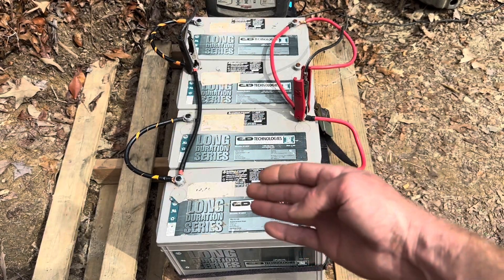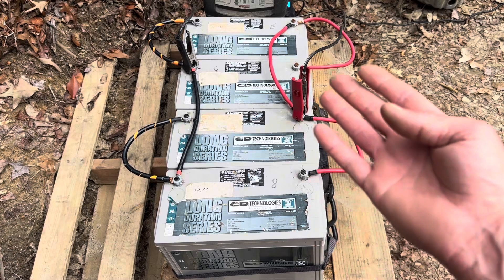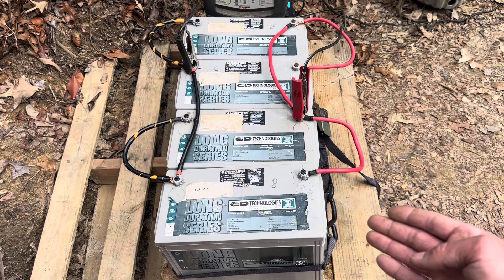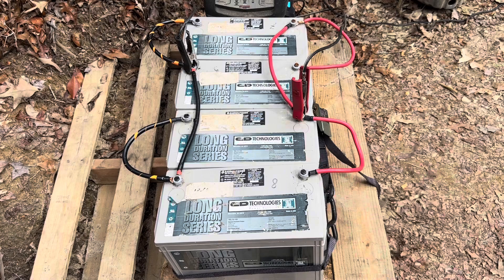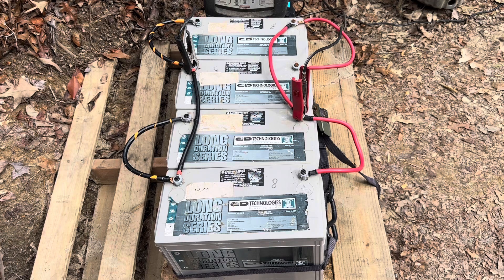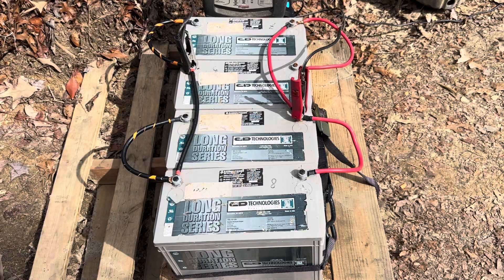This will work for any pack with an even number of batteries - six, eight, tens - it works the same. I hope this helps somebody with wiring their batteries in an equalized way. It's a straightforward method, no extra wire cost, and you get a longer lifespan and better performance. Instead of one battery getting drawn down or hit hard, they all share it, which will increase your battery life whether it's AGM, lead acid, or lithium. Just remember: same gauge, same length. Thanks for watching the off-grid mountain homestead - if you're not subscribed I'd appreciate it. Leave questions in the comments. Until next time, I'll be out here where the grid don't go - y'all have a good day.